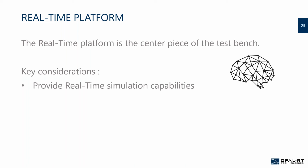So you have function generators that do enough functionality to generate signals to simulate the bench and just do a point-to-point checkup on the controller to see if it's saying the right thing. For example, setting a signal for pressure. If I'm setting this voltage, do I see the right pressure, or maybe temperatures? But there are no closed loop interactions.